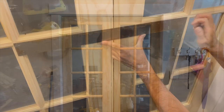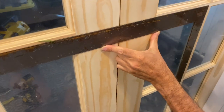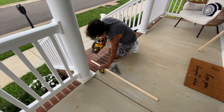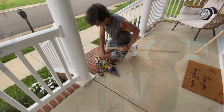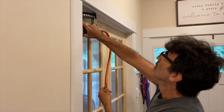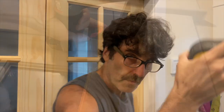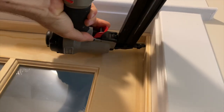When you put the knobs on, I usually draw a line across there like that so that they're even on both sides and you don't have one up and one down. What I'm doing right here is installing the doorstop so that the doors won't push through when you shut them. Go ahead and do that — we're having some trouble with the air gun.